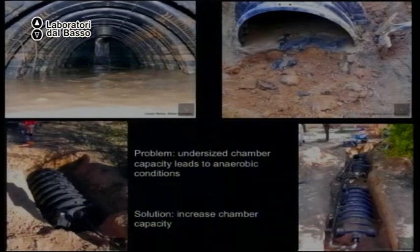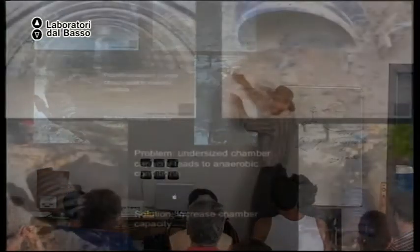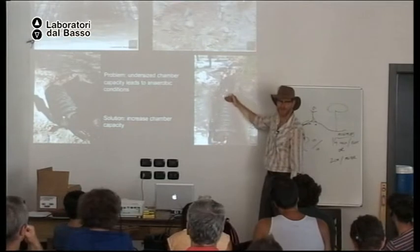One other thing, it's good to put the gray water into not just one end, but to split the flow to direct the gray water into multiple ends. Otherwise, there is a risk that the soil will go anaerobic where it comes in and slowly grow that way.